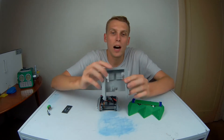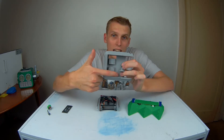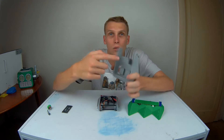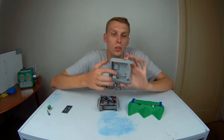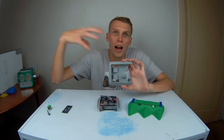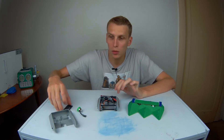I have tried in the past to push the wheels back a little bit — this here is one of those previous attempts. As you can see, I pushed the wheels back but not far enough, so there was nowhere to fit the electronics, and it didn't fix the issue of riding along that back edge. That chassis never got fought because I couldn't fit the electronics without running into the drum or the wheels. In the new design, we're going to put a wall along the front so the electronics are housed, and add wheel guards so I can jam things in without them getting into anything spinning.